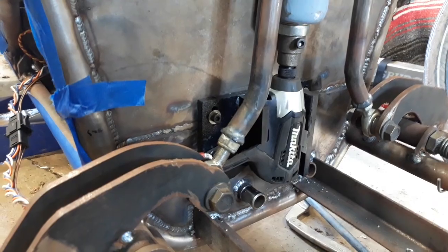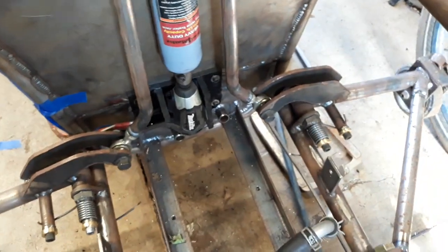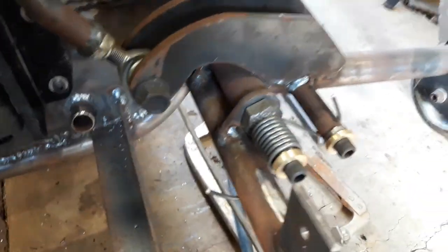What I wanted to do was build a mechanical positive lock system that I knew would work under load — locking up and locking down, and electrically actuated. So I ended up mounting a Makita impact driver to a Harbor Freight trailer jack. I modified it and pulled the guts out; it has a kind of an acme screw, and I used the drill remotely to trigger that so I could actuate it up and down.